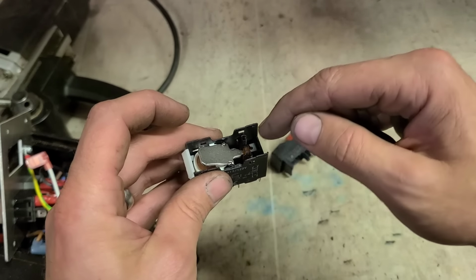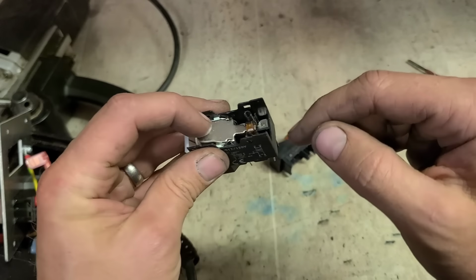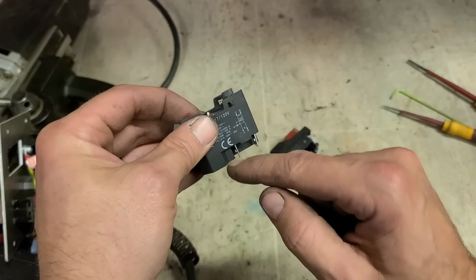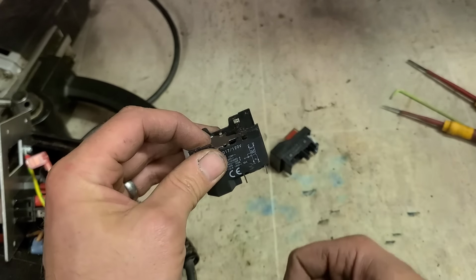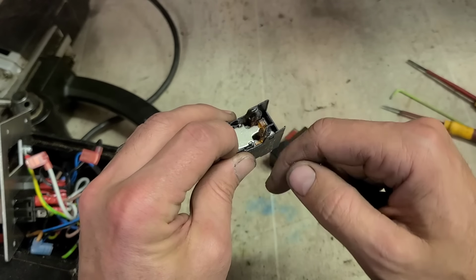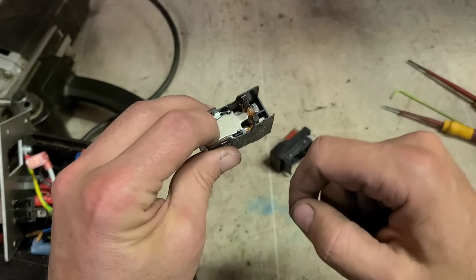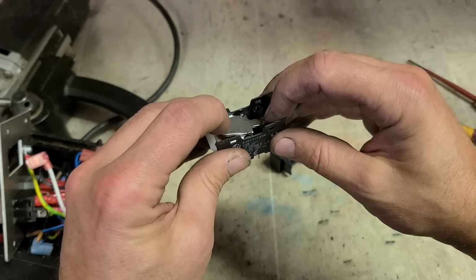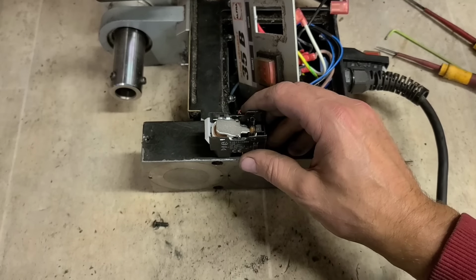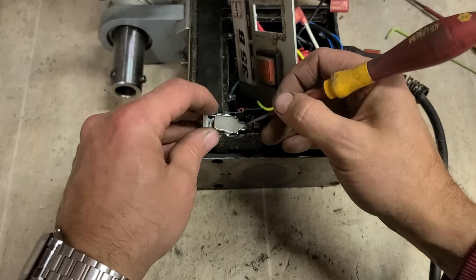So the red button is this, the green button is a steel plate. So as you press this down, it lifts this bar in the middle and connects these two prongs together. So the live goes to the motor, the neutral goes to the motor. And this metal plate, whenever it goes down, activates the electromagnet. That becomes a magnet, sticks the plate down. So that won't release again until you either pull it away with the off switch or it loses power. But I have to see if I can fix it without messing up the actual switch side.